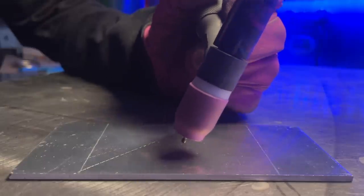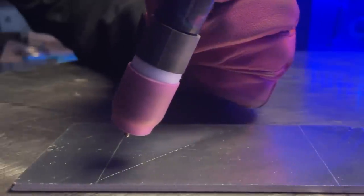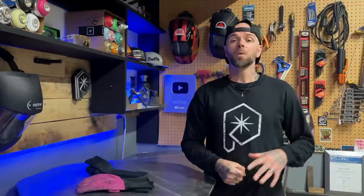The first thing that most commonly happens is that in order to prevent dipping or contamination, somebody's going to increase the standoff distance. When somebody tries to feed filler material into the weld pool, the end of your filler rod is going to become melted or blown off completely before it even gets into the weld pool. Whether it's with stainless steel or aluminum, this is absolutely something that happens to everybody. Comment below if this is something you've struggled with — you're not alone.